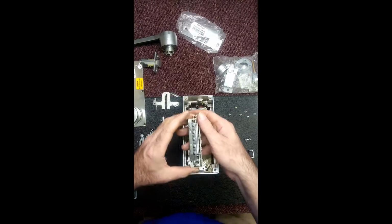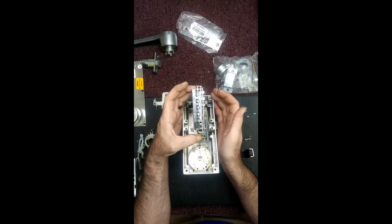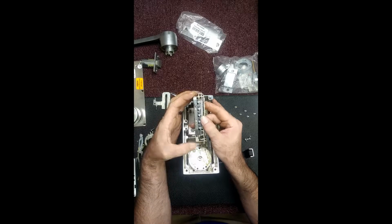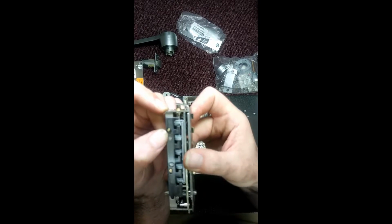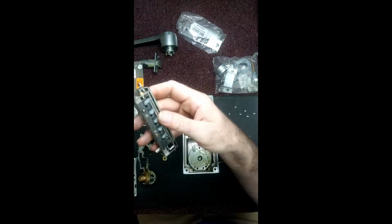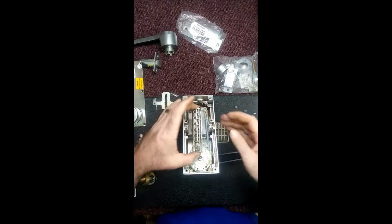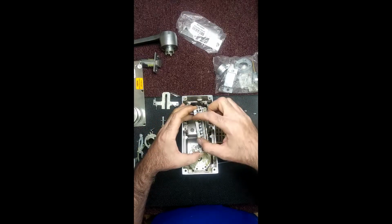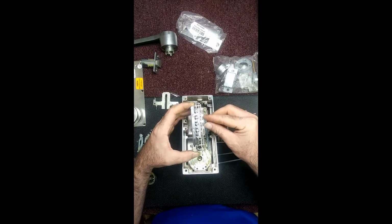Alright, so there have been videos done in the past that say if you pulled a rare earth magnet over here to the side, this will be sitting in there like this, and you can manipulate these locks. What I found makes me wonder if they're removing this prior to doing the video and making it work, or maybe it was just a bad engineering design in the past. But as you look at it, there's a clip right there, and that's going to prevent this from moving or being pulled out of place. If you were to use a rare earth magnet over here, that would interact with that, because that would pull that out. If this piece wasn't here, it would fool the lock into thinking that it's a positive combination every time.